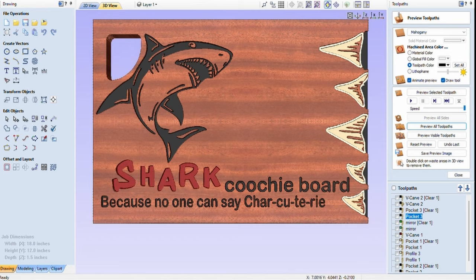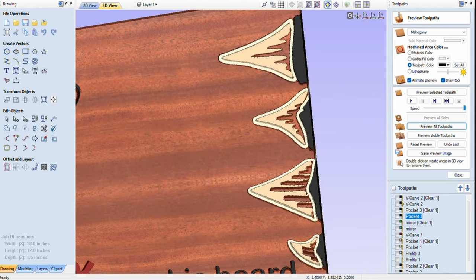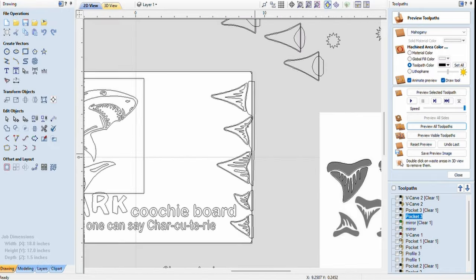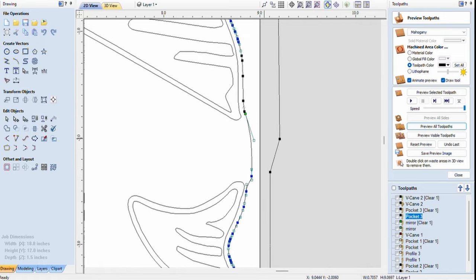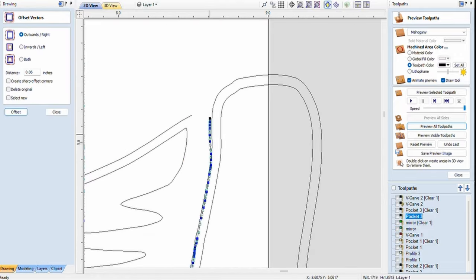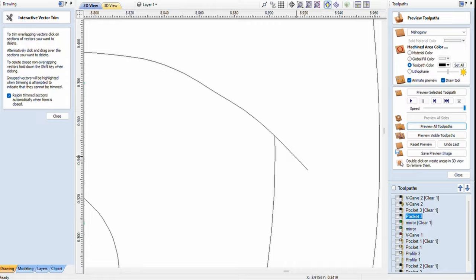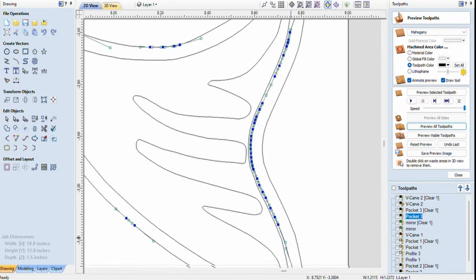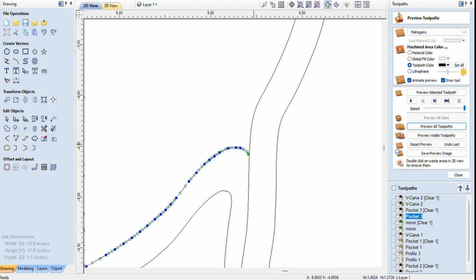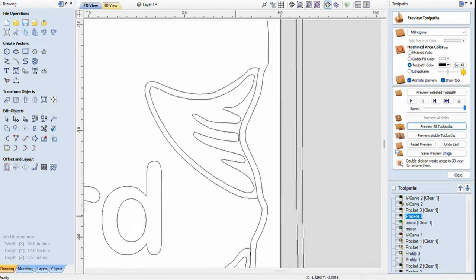In this case, it would be the walnut that I'm going to use as my backdrop of the cutting board. So here I'm just going to go ahead, and this is actually going to work out to be my Wenge gum off the side. I'm just going to unite this real quick, drag these vectors, clean them up. Once I get the gum established, I'm going to offset it by 0.06. The reasoning you'll see later on, but here, now I'm just taking that offset and using my cut tool here, and then just making clean roundovers and cleaning up the outside vectors of this tooth, which will be labeled as a maple outline from the video. So just tweaking these a little bit, making them look a little bit cleaner and more pronounced. That way I have an outline toolpath for said maple outline.